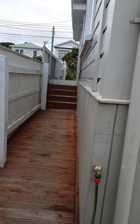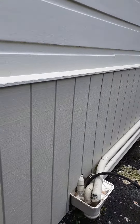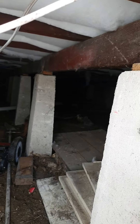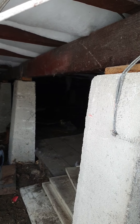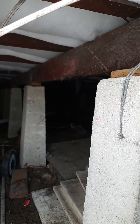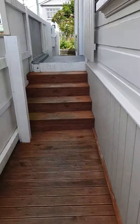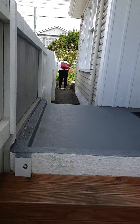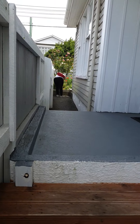Before it gets out to the main, you could re-run these pipes. I've just spoken to the client about re-piping it all and slinging it through underneath the house. It does go up a slope to about three to four hundred at the other end, so you'd probably have to run them up high and may have to dig out a little channel to run it through to the other side and join back into the drain. Otherwise that would mean digging up through here, through the deck, and digging up the concrete on the other side. But you could actually come through the side of the house and back in if it's level on the other side of those stairs.